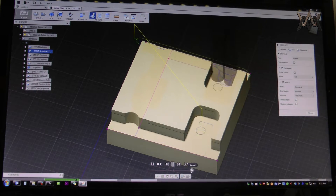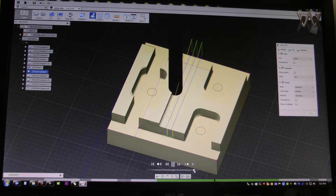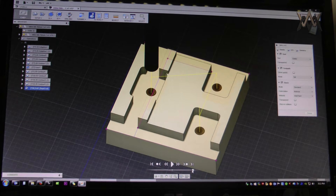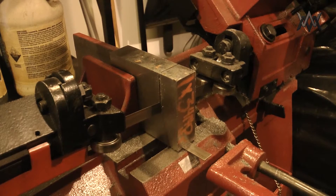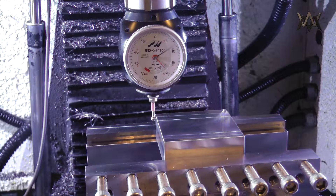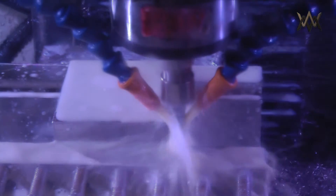I have my reservations because those Pit Bulls are only holding an eighth inch of material, and that's a two-and-a-half inch tall block, so there's a huge leverage force going on — but they're rated for 3,600 pounds each. With that, let's jump right into sawing up some stock. I didn't get footage of squaring it up, but we'll dial it in and use our CAM post from Fusion using those 2D adaptive clearing toolpaths to cut this thing out.